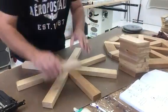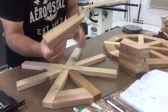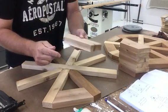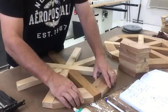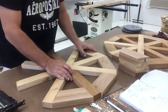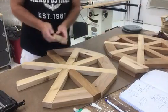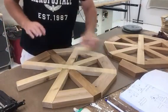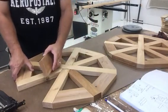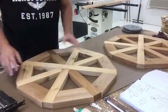Here's the outer band on the water wheel going in. These are all cut 7 3/8 of an inch on the top and it's cut at a 22 degree bevel. So that makes a perfect circle, just like that.